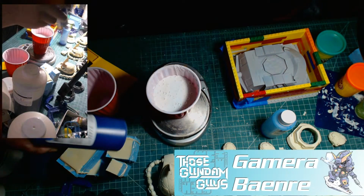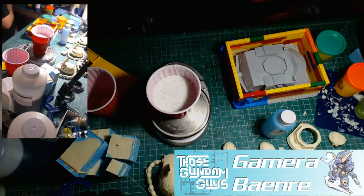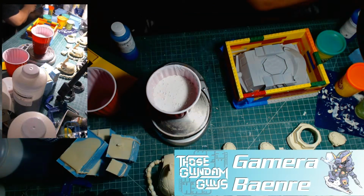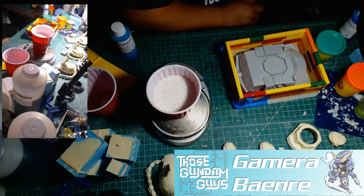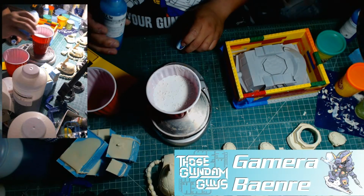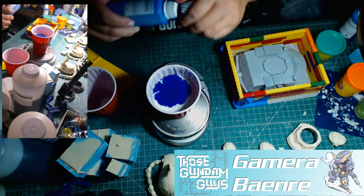The catalyst will need to be 10% of that. Sorry about that. Trying to watch myself, make sure this is live and working. Let's see here. So I need about 39 grams of catalyst. I'm just going to use a calculator. My 385 plus 10% would equal 425 as my final number. So I'm just going to dump all this in here, and my magic number here is 425.